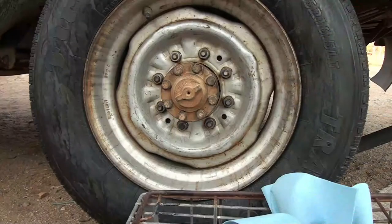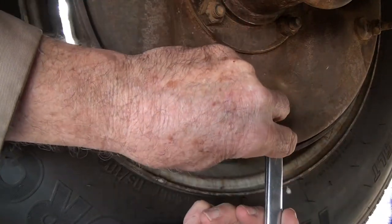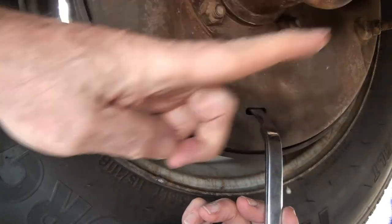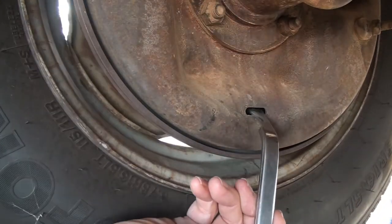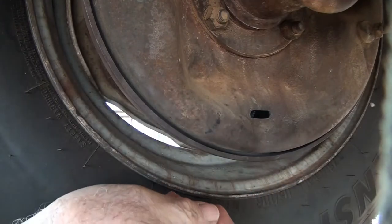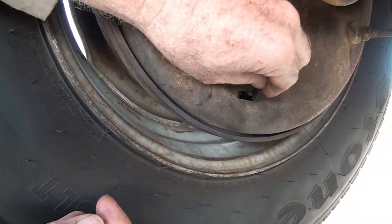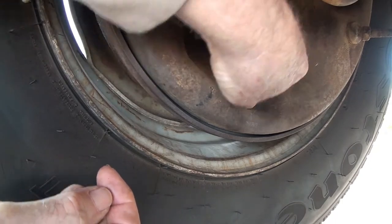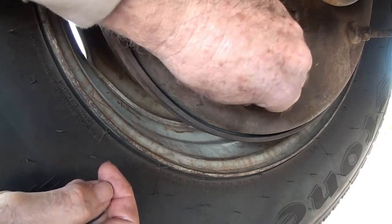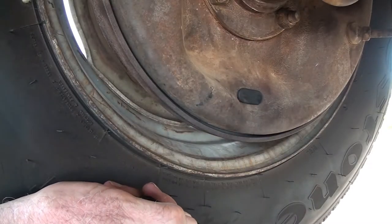I'm going to go around underneath now and tighten the self-adjuster. Okay, I want to reach in here and get that wheel, and clockwise I believe would be going this way. If the wheel's this way, clockwise it would be looking like that. So I'm going to tighten it up a little bit at a time. Okay, that's plenty of drag for me right now. So if your brake springs kit came with rubber plugs, go ahead and put those in if you don't have them on your wheels already, because it helps keep the water, dirt, and dust out. Okie doke, that one looks very nice.